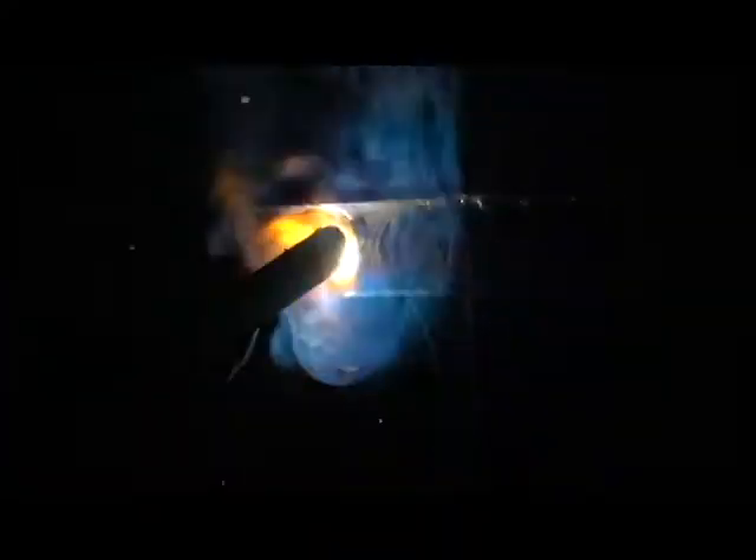At the beginning you can see how I struck up, came back, and made a little circle — you always want to run your 7018s that way because if there's any trapped slag or porosity, you want to burn that out. You can see how I've got my rod just a touch above that bottom bevel. You can run your rod pointing right at the edge of the bevel, or like I do — come up just a little bit above it — letting the bottom toe of that first weld tie in. That makes me a little quicker when I go to cap. Some people run it down just slightly to make sure they don't miss that edge or get undercut, but it's all up to you. It saves me time and lets me put a two-bead cap on and get away with it; some people may need three, and that's okay.